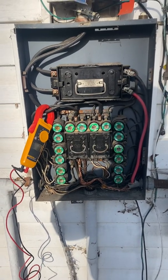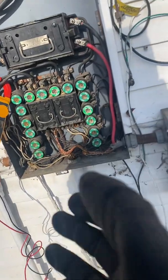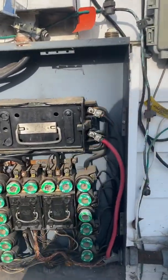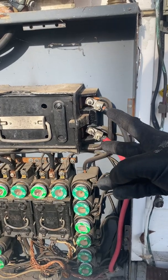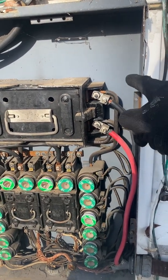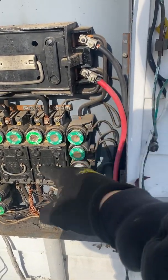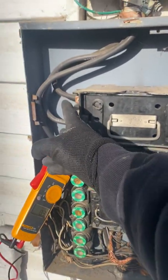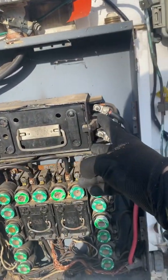If you have a defective fuse, you've checked your voltages and you don't have 240 volts between the two lugs, but you may have 120 from ground to one lug and ground to the other lug. You'll have 240 on the side where it comes in, then it goes through the fuses.